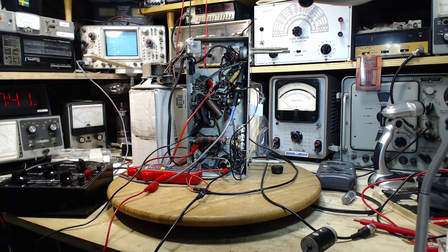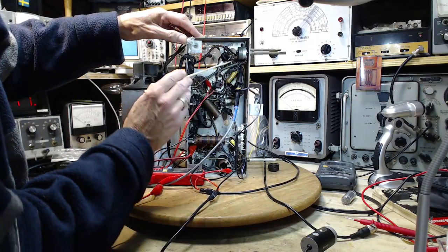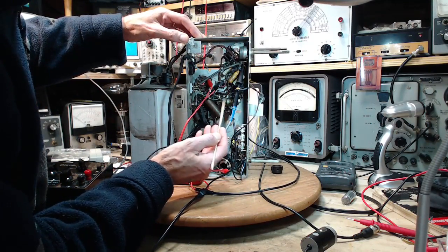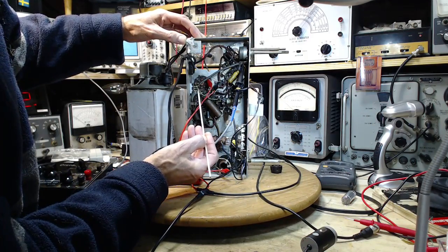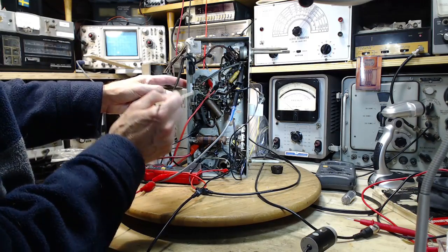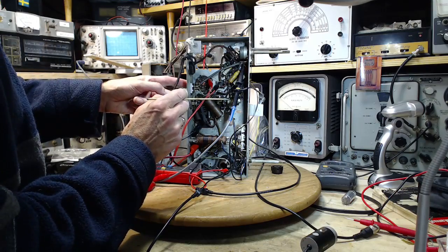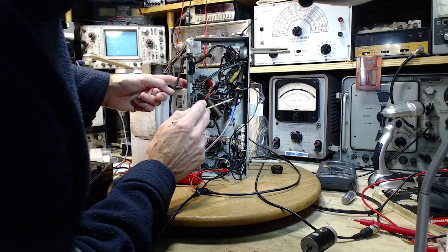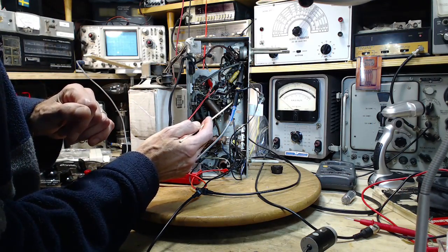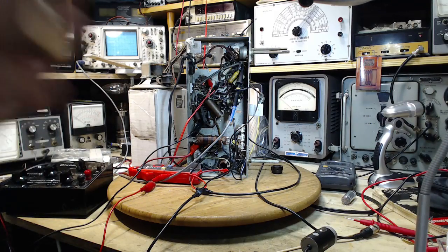Just looking for my pointing stick. Here it is. So look at the volume. So the volume comes here. That's probably it there. Out through this selector switch here, which is selecting phono or the radio. So it comes down here. This is just a post, just a terminal in the air, finds its way to this capacitor here, which I'll bet this terminal is grounded here. No, wait a minute, that's not right. This is the one that's conveying. This shouldn't be grounded. This is conveying the signal. So we'll cut this guy out and we'll test him. And then we'll replace it.